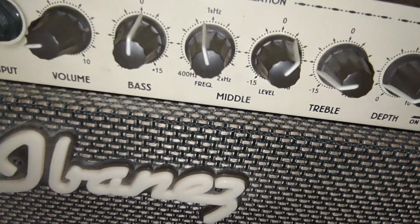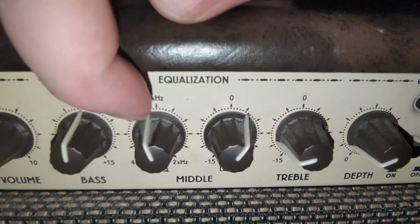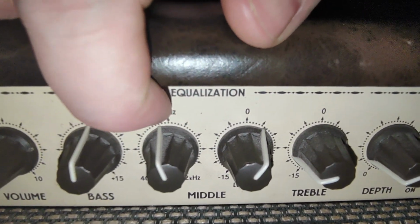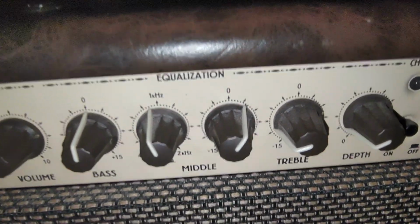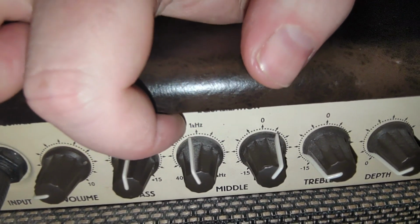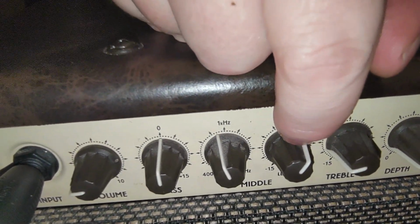Let's take a look at where that's at. So with the voltage increase going off frequency, like I said, slowly, stop, watch. I turn slowly a little bit, then stop, and look. But I see that my amplitude is increased. I don't know how much slop is built into the tuning circuitry for your mid-range. But essentially your 1 kilohertz is not on dial, it is off dial, which is why you saw the amplitude increase even more.